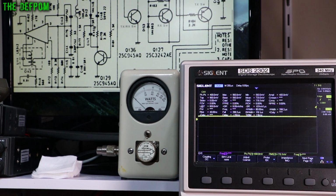So there is a bit of a voltage there on the sidebands. Upper and lower sideband, there's a slight offset voltage there of 700 millivolts. So it's doing some kind of switching there. I think it's got some diode steering there through D142. Where's D142? If I can find that, I can check for that. There's D142 down here. Yeah, it's coming from there, I think.